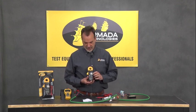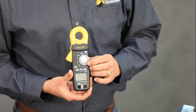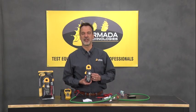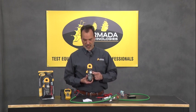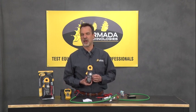Last but not least, the ohms reading has been changed from a fairly low continuity test ohms reading — which you could turn off to go to a wider range of 600,000 ohms on the 95 — so that on the 95i it's going to default to the 600,000 ohm range. If you want to take it off that, you can, but again we're defaulting to the settings that most people want to use anyway.